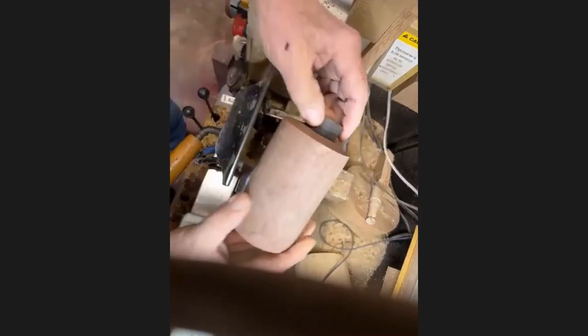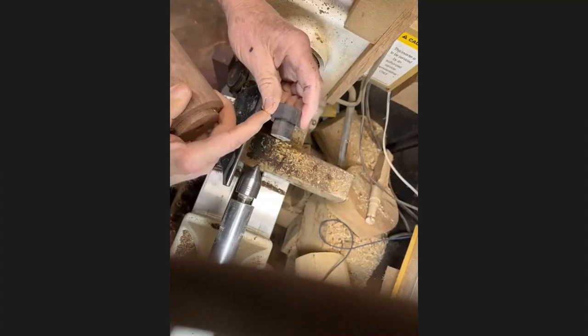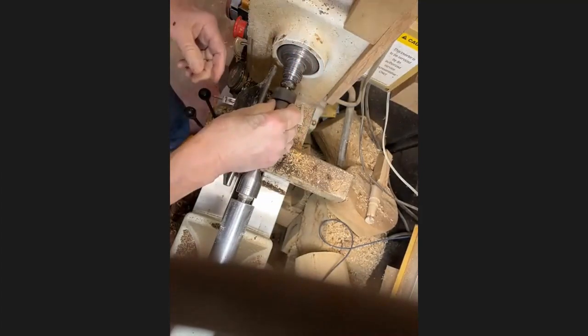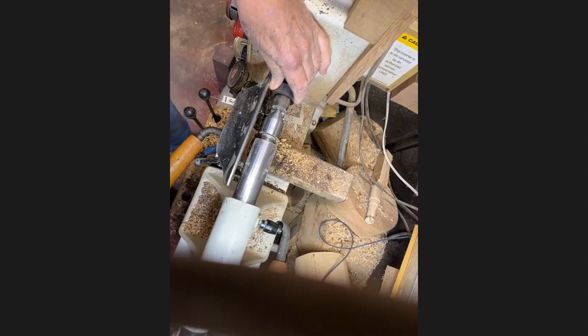So what we're going to do is we're going to slide it on there, and you see that now the outer rim just fits, except where you heard me catch that thing. You see how I scraped up that edge? So what we're going to do is we're going to make a sideways cut, or what we call the dome cut, when we're doing an insert. And we do that with a spindle gouge. Let me put this back up in here.